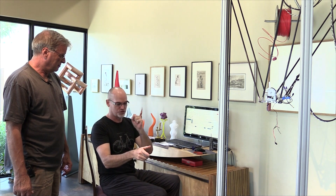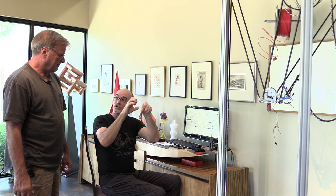Ideally the machine will print faster and better with this new extruder. It's like a hot glue gun — you heat it up and squeeze the trigger to force the glue through the nozzle. Here, instead of a trigger, there's a little motor with gears that grabs the filament and shoves it down into the hole. This new extruder is the Bondtech QR, in the three millimeter size because that's the filament size we use here.